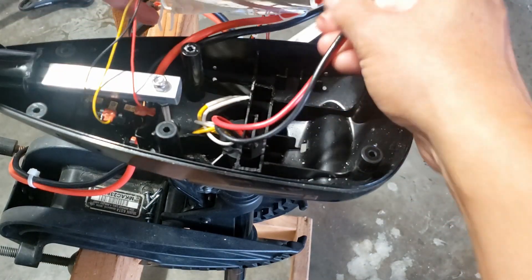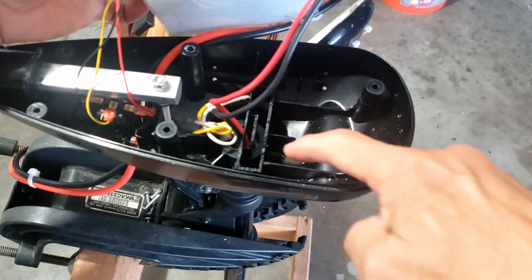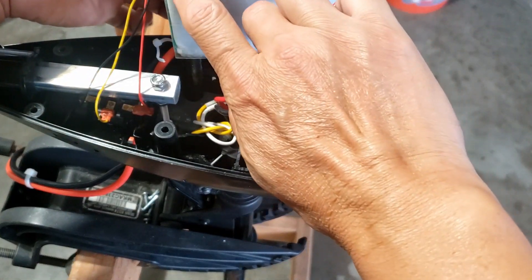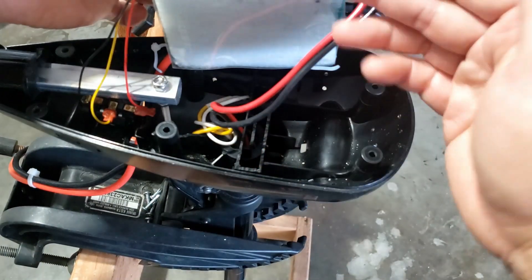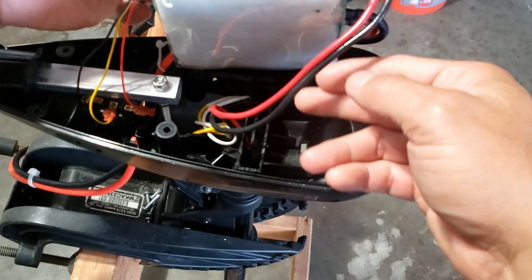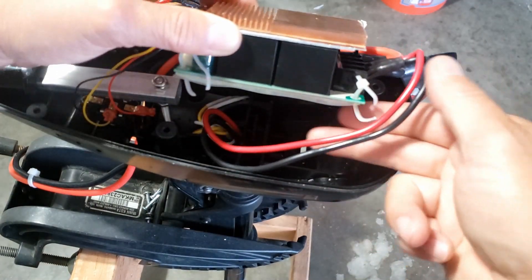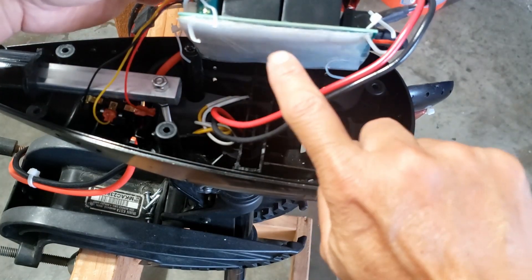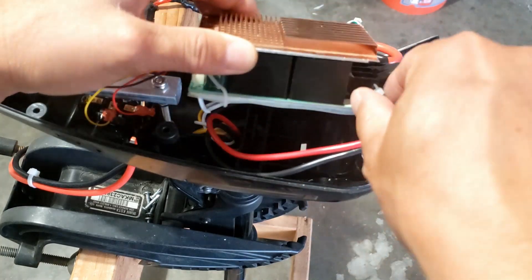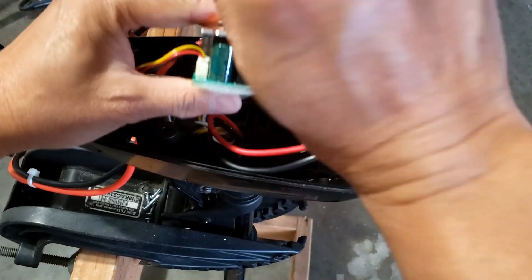I also cut away the original plastic. I added a piece of foam padding here because the PCB on the bottom actually has a lot of exposed contact points. I laid it down in there to prevent any possible shorts. I added this piece of padding using double-sided tape — very easy to add on.